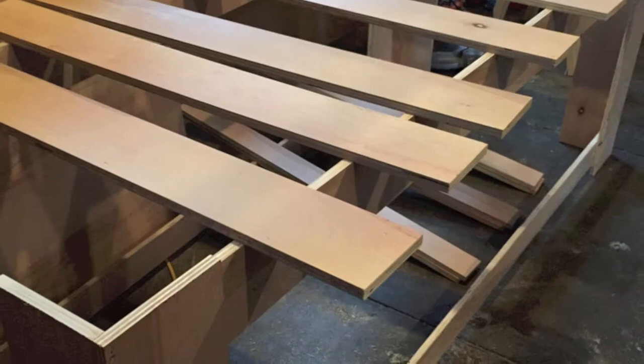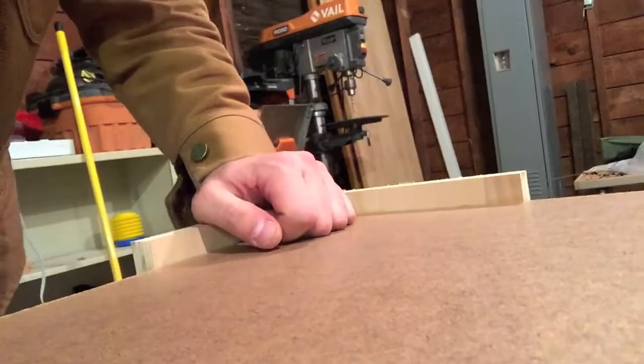It's been a long day, probably about five o'clock, starting to get dark outside. Been in the garage all day, back's starting to hurt, but got some good progress. The main frame of the table is pretty much done. This is test-fitting the hardboard into the frame — there's still three-quarters of an inch to put some MDF underneath. I did account for the hardboard being about an eighth of an inch oversized in the width, but in the length I didn't think about it, so the hardboard is actually an eighth of an inch over in the length. Got to take it down — better to be bigger than too small.